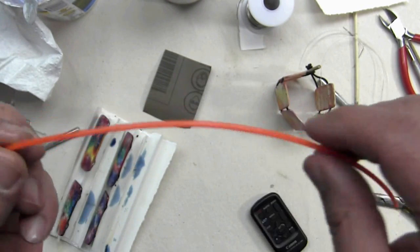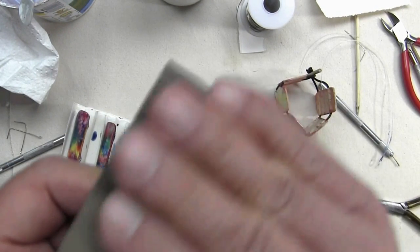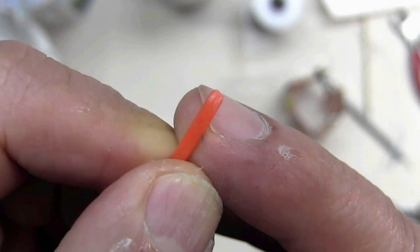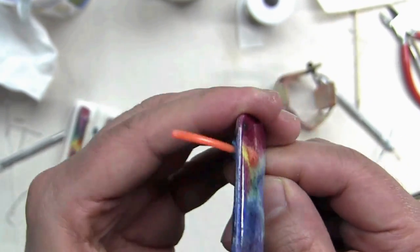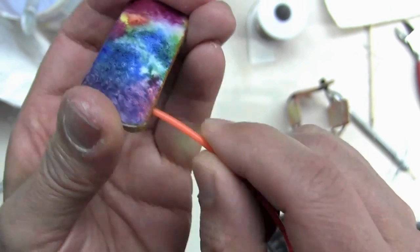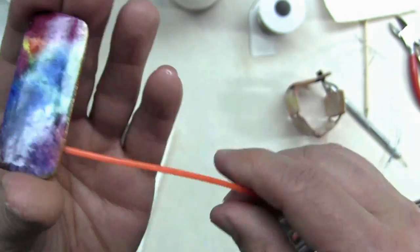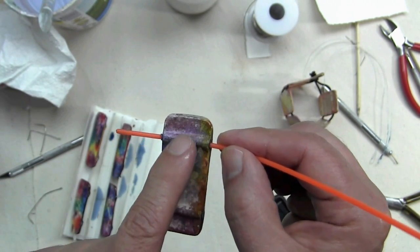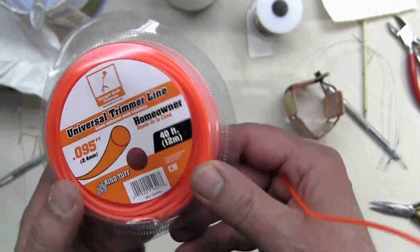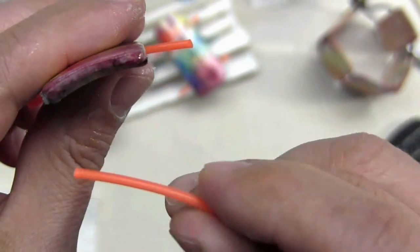Remove it from the oven just to check the progress of the wax melting — and there you can see it is oozing out. The objective after you've taken this out of the oven is to make sure the hole is cleaned out nicely of wax. What I've done is taken a piece of really heavy-gauge weed whacker cord, cut a length off, and sanded the top to make it round. That's an effective tool for ramming through the piece when it's still warm and pushing out any excess wax, and it also helps redefine the shape of the opening and makes it round. Universal trimmer line happens to be 0.095 inches in diameter, or 2.4 millimeters.